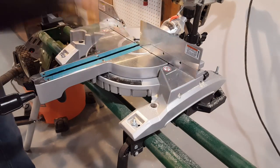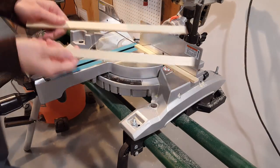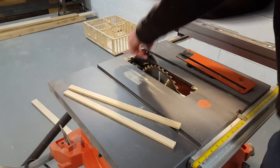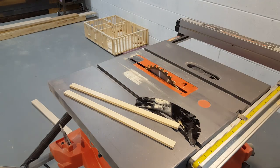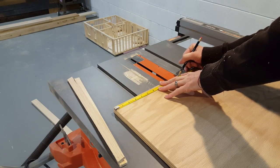The sled is going to be about 13 inches long so I'll make my two rails that size. Now that I have my rails done I need to get the blade below the finished surface. I'll mark the center of the board which is 11 inches and then line it up with my fence.